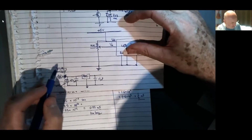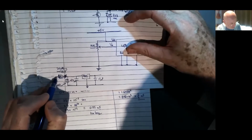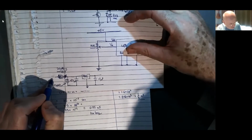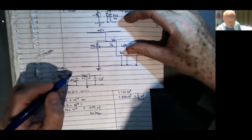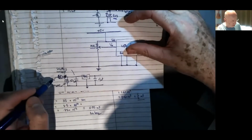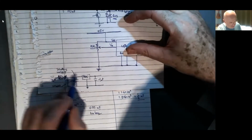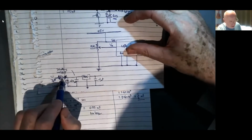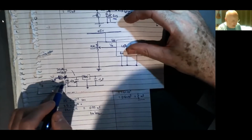I've got a Schottky diode, 1N5817, which is a high-speed diode. And that feeds the pulse in that comes down like that there. And I've got to be careful at this volt here. Oh no, we're talking about rubbish here. This is my protection diode for the power circuit, sorry. It's got a bit of smoothing there. But this is in case I connect the battery the wrong way around, which is not unknown for me. Right, so that's the power circuit done.